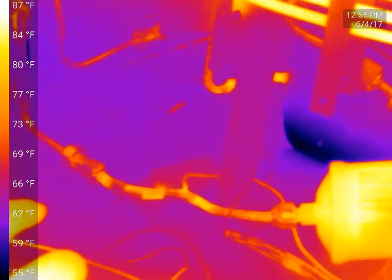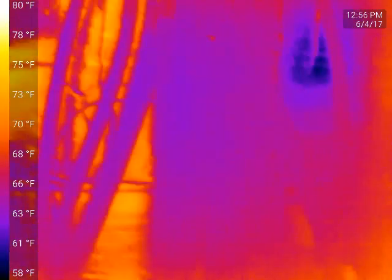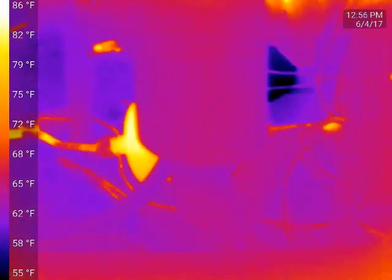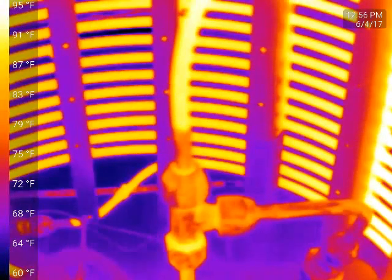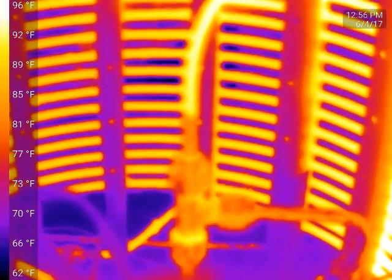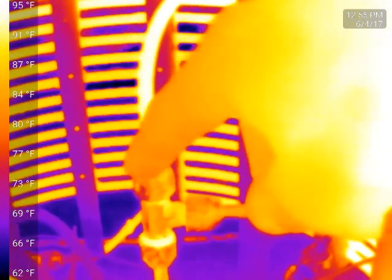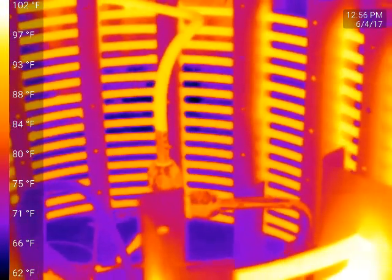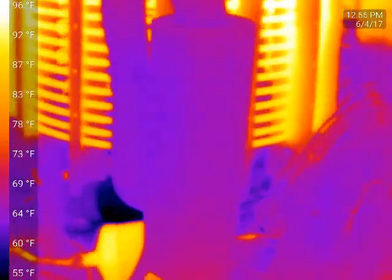Now there are emissivity differences here. This is shiny copper — you can see the reflection in my hand, and kind of a ripply reflection in the poly-iso. Here you can see the difference. This is the brass fitting down here — a brass T, quarter-inch flare — and then copper line coming out of it. That's where the black paint starts, so that's why it shows up so much warmer, even though it really isn't. As far as the black body goes, it shows up a lot warmer because we're set at emissivity of about 0.97 right now.